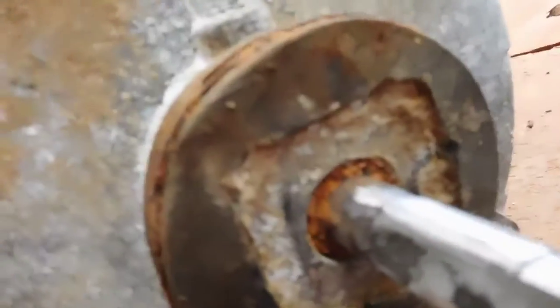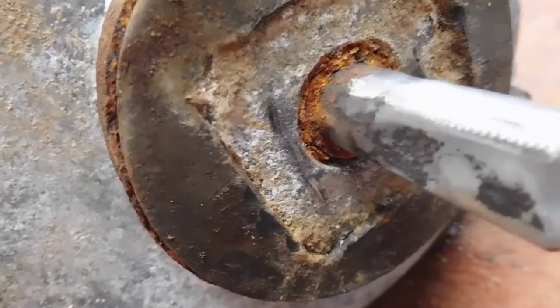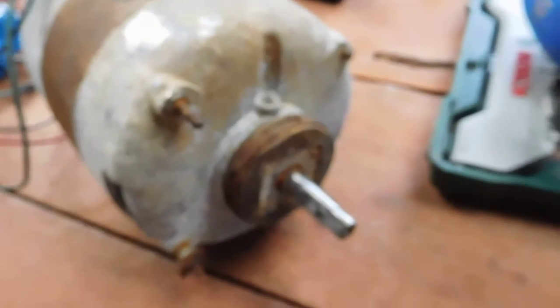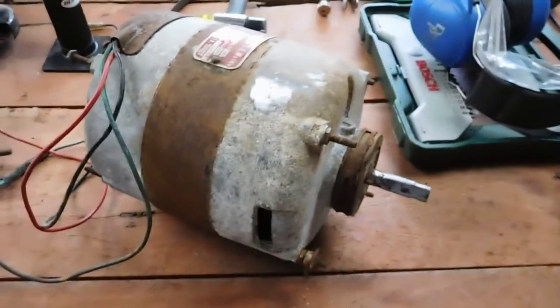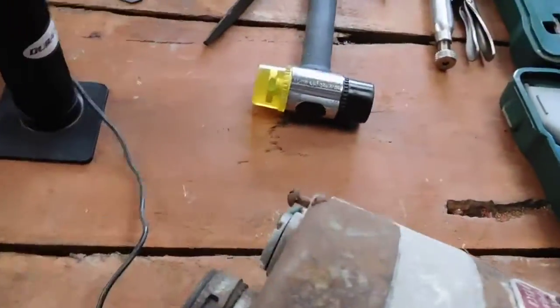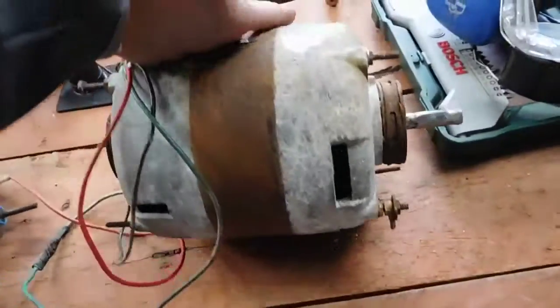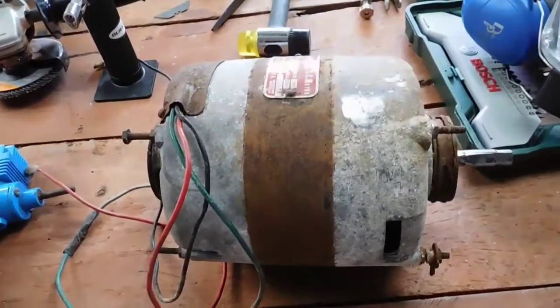It's pretty well seized up. That looks like the main bearing in there, and as you can see, it's pretty much caked with rust. It may or may not work again. I may end up just drilling it out and putting some radial ball bearings in if I can't get sleeve bearings to work. From what I can tell, the main windings look alright on the motor. I've checked them — they look alright. But I'll at least make an attempt to get these end bells off to see what it's like inside.